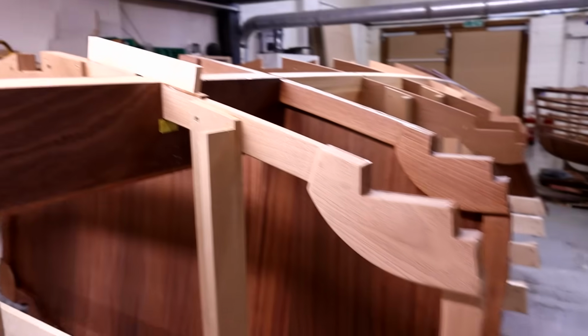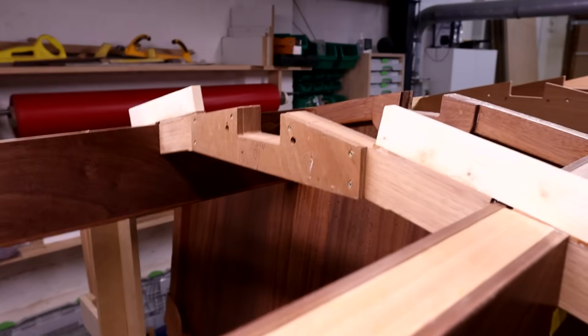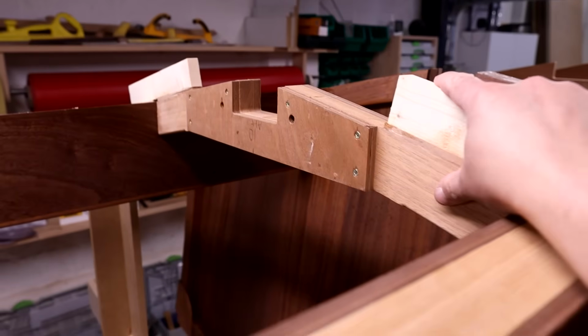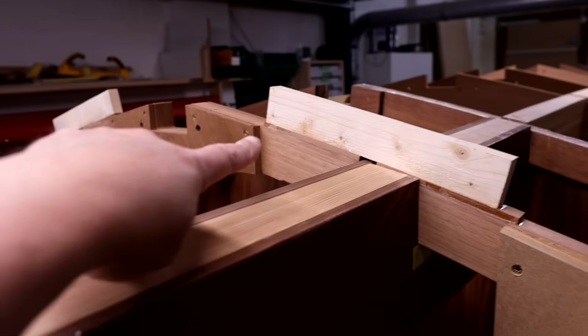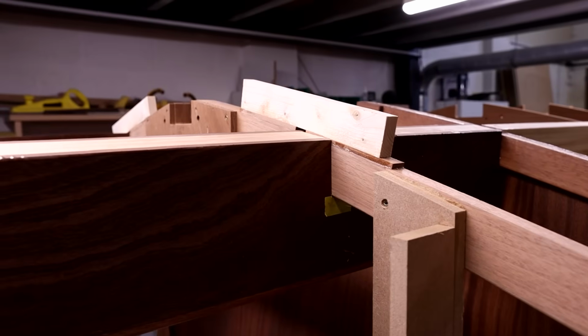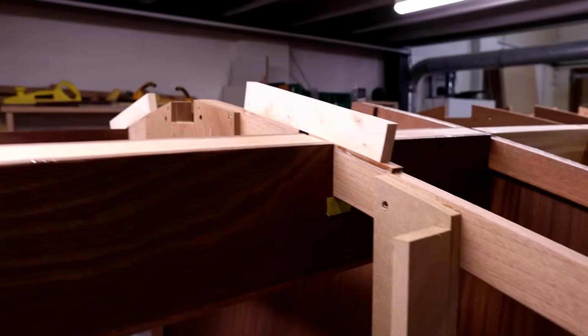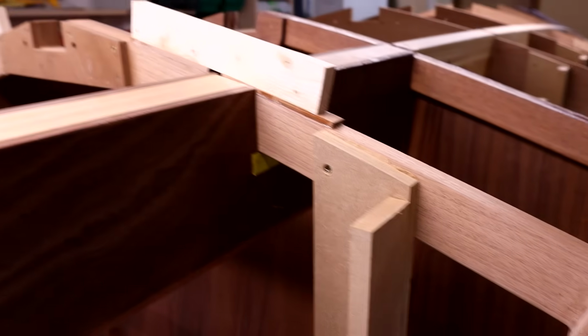Okay, so there we go. There is 10 in place. We've got the central portion just held in place currently by these little bridges, but that's allowed me just to maintain that perfect continuity of the frame throughout the notch here, which otherwise would have been a struggle. So I've got that down at the correct height now. It's back on its true position on the legs.